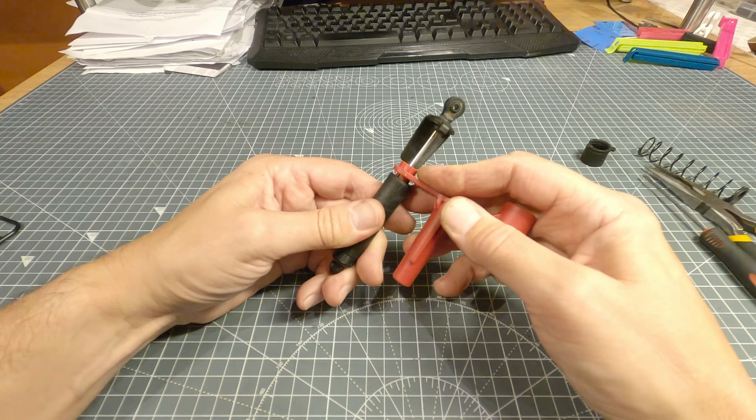Another thing: the receiver is in this box under the ESC. They say it's waterproof but I don't think they ever really are because of where the wires come out. What I've done is use the hot glue gun method — I've got a video on that. You basically take the receiver apart and put hot glue in, being careful not to glue up any switches. The receiver itself is now waterproof, so if water trickles in it won't be harmed.